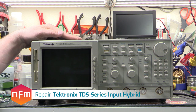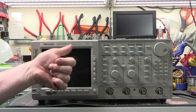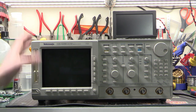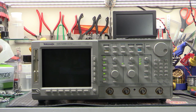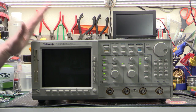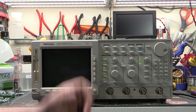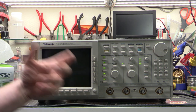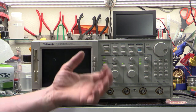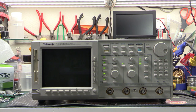It's scope day - got another scope on the bench ready for some good old-fashioned healing. This is a Tektronix TDS 620B, a two-channel digital real-time oscilloscope, 500 megahertz, 2.5 giga samples a second, with a black and white screen. It has a slight problem: the calibration side of things says calibration is no good. There's a common problem with these where the inputs have hybrid ceramic circuit boards with relays that over time wear out - the contacts go high resistance and when it does its self-checking on boot it fails.